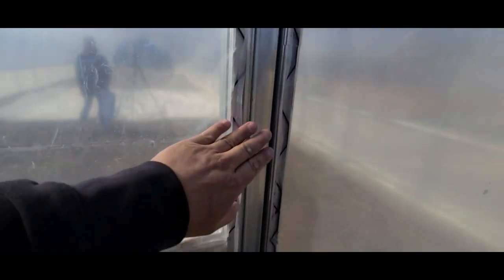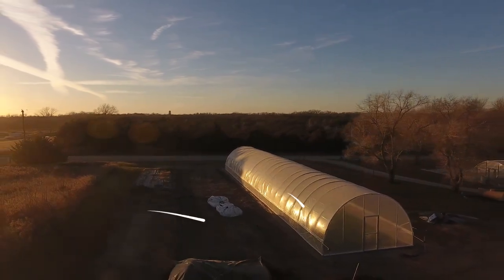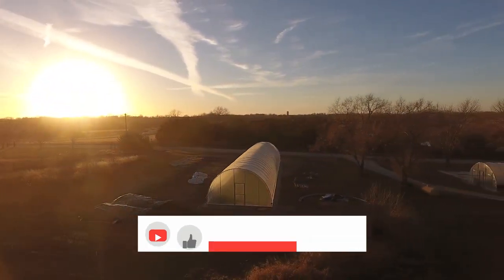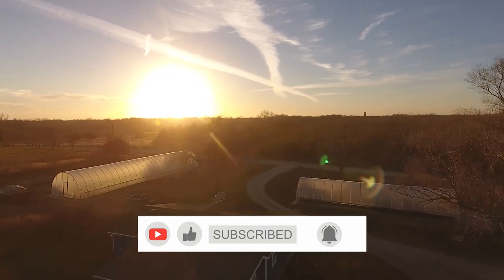From the outside you can see everything is nice and square. This kit goes very easy — all you have to do is put your channel lock on everything and then put your wiggle wire inside the channel lock after you put plastic on, and that will pull everything nice and tight. Around the hinges and the base of the door, everything is nice and tight. That's a loose walk-through of how the door kit and end wall kit is installed on your all-metal Bootstrap Farmer high tunnel kit.